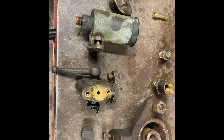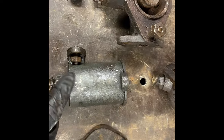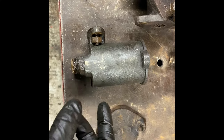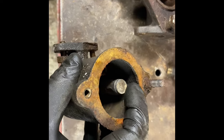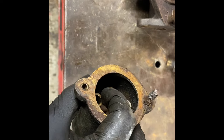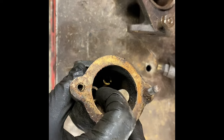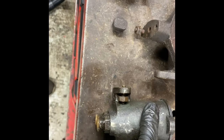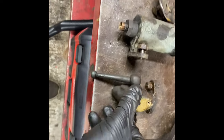Then from there it's exactly the same, but paraffin side. See, there's the lid, wing nut, that's pumped from the main pump up into here. So this is your inlet, this one here, this one is your overflow, and that one in the bottom of there is your outlet. How it works, it pumps to a constant level, which is this level here of the overflow, so it's always got a head of fuel. It then comes out of there into your three-way tap.